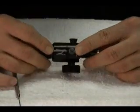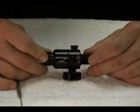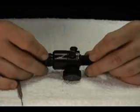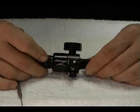When a blowout occurs, you will need to replace the low pressure burst disc and the piston, and clean the inside of the reg. This can be done with the reg on the bottle, but will be demonstrated with the reg only for easy reference. You do not have to remove the reg from the bottle.